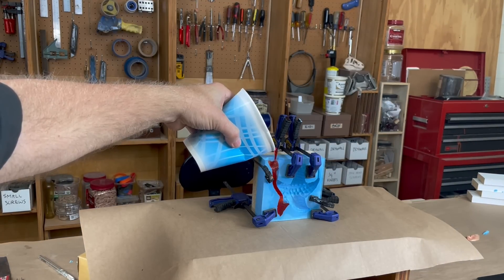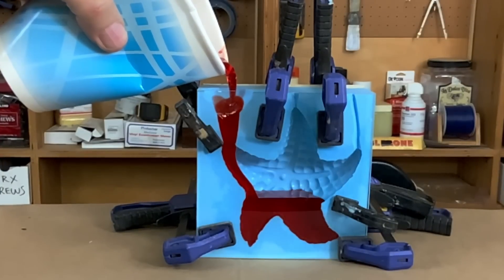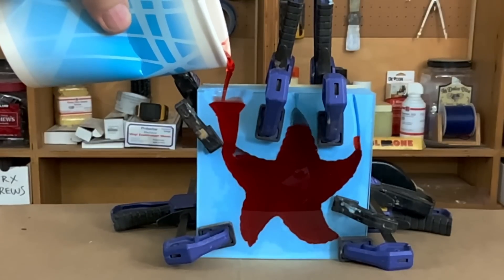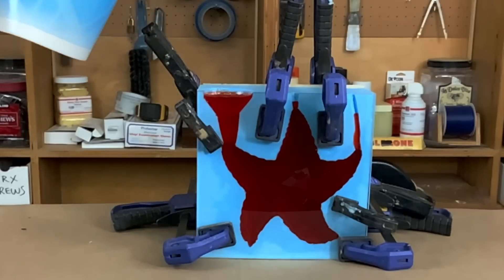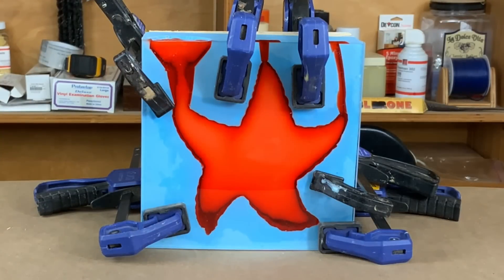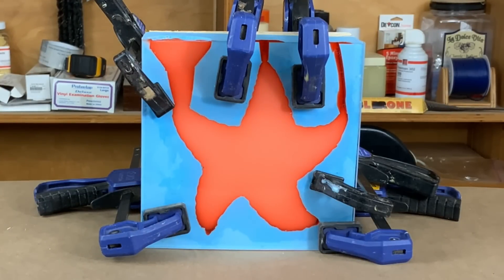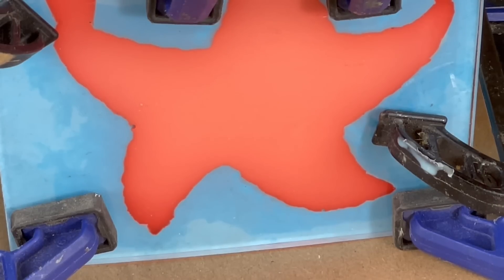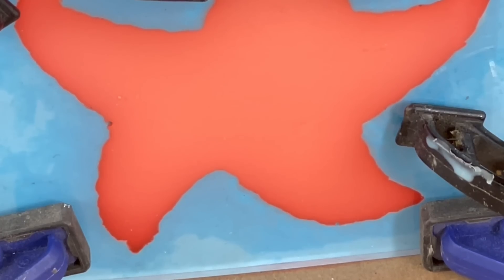I really wanted you to see how a mold fills. The resin runs down the sprue to the very bottom of the cavity, then rises evenly, pushing the air out above it. Now you see the importance of the vents — they're like little chimneys that let the air out. That's why you always position the vents at the very top points of the cavity. For fun, let's watch a time lapse of the resin cure. Watch how it cures quickly in the middle and then slowly cures out to the edges. Notice how the vents are the last things to cure. Tiny parts cure a lot slower than big bulky parts. Areas that touch the mold are the last to cure — it's one of the reasons why the resin eats the mold, because it stays liquid much longer right at the edge, giving time for the resin to attack and break down the rubber.